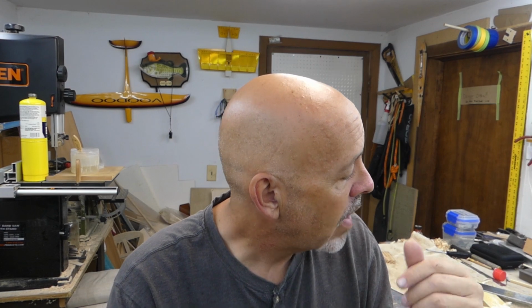What I would prefer to do is probably do it when it's epoxied on there setting up, because I'll be using at least probably 1 hour epoxy. What I'll probably do is put that on, tape it on there, put the screws in just temporarily to hold everything into position, because I've got to put something through. I've got to figure out how to go through the fuselage to put little marks on the inside of the aluminum panels, and that's where I have to drill the holes through for the cabane struts. Nothing for the landing gear, but just the cabane struts and the front cowling screws that hold the whole cowl to the front of the fuselage.